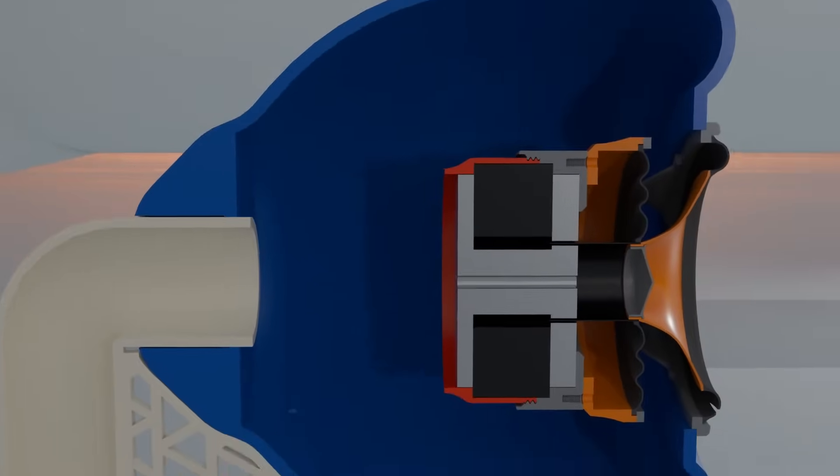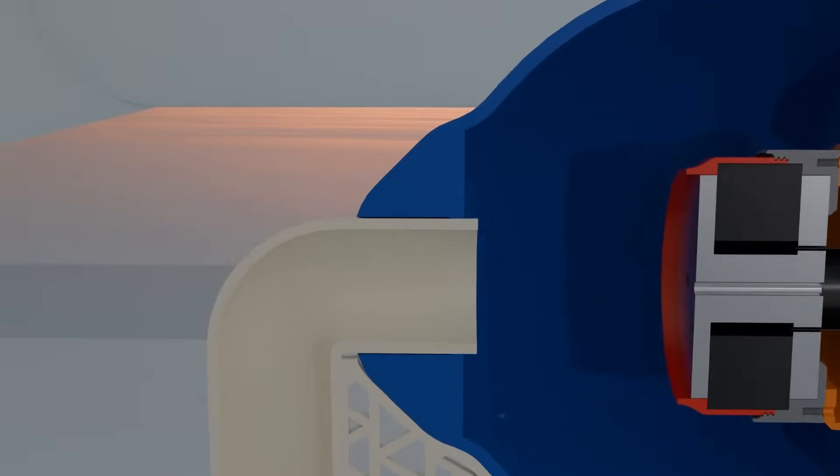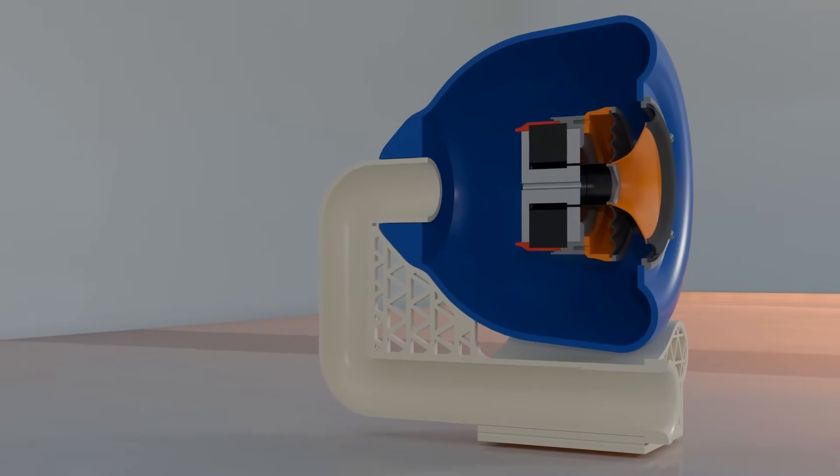Looking at the enclosure and port, we see this design lends itself to additive manufacturing. The 434mm long port is printed with a support brace to help hold the large enclosure. The port is also printed in two pieces to allow for assembly into the stand. A large flare was added at the front. The whole enclosure, port, and stand consume roughly 2kg of PLA.